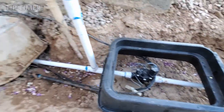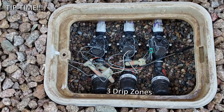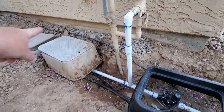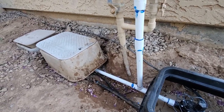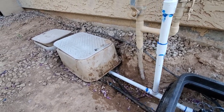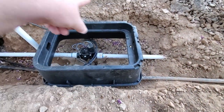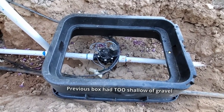Something I learned from previous repairs — I repaired all the valves out of two boxes. I put gravel at the bottom of them, which is great, but I ended up putting dirt around the edges, and ultimately when rains happened and valve issues occurred the mud would mix in. The best case scenario is to put gravel all around plus underneath, and that'll give you a cleaner valve box.